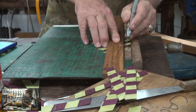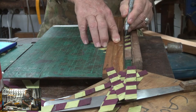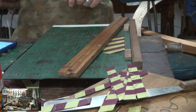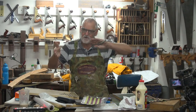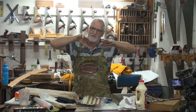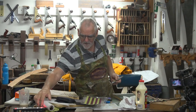So as you've seen, there's a right side and a wrong side to veneer. What you can do is have half wrong side, half right side, and that will give you a flush in the chatoyance. When you wobble it, flash one half and then go dull on every second diamond. Then when you turn the other way, the ones that went dull, they'll flash and the other ones go dull. The whole heap of things you can do.